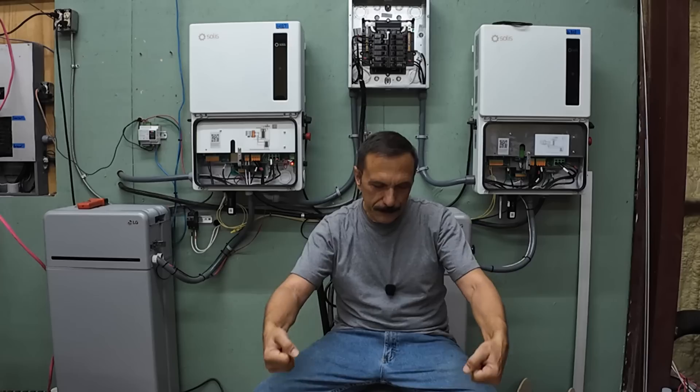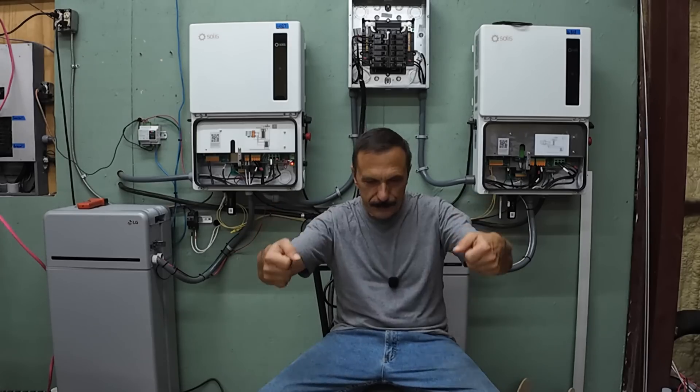Why would you choose a high voltage system over a 48 volt system for your home or even off-grid? Well, first thing would be wiring runs and copper gauge. Instead of massive and expensive 4-aught cable, we can run normal number six or number four THHN that you can get at Home Depot. As for the batteries, most manufacturers are going to stacked cells now, and with those you just have packs that you set on top of each other. When you set it down on top, it automatically makes the connection, versus a big parallel 48 volt bank with massive cables.